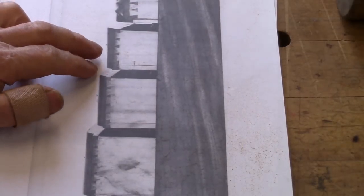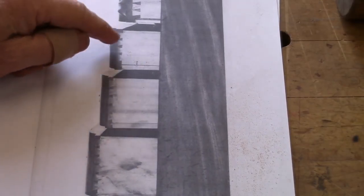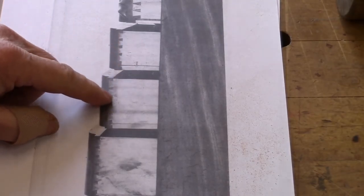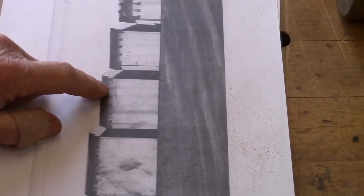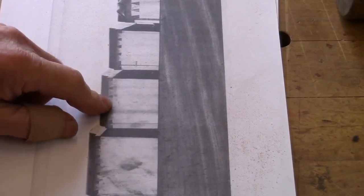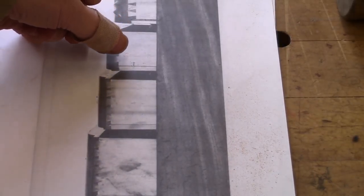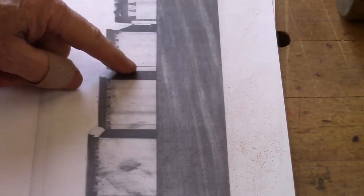This is a photograph of a Townsend Bureau. You'll see the very small dovetails on the side of the block drawers — they're only a quarter inch wide because this edge is only three-eighths of an inch, so they're very shallow. The other thing that's unusual about Townsend's drawers is that you can see the drawer bottom through the side.